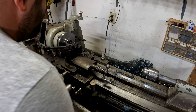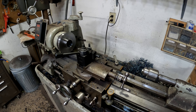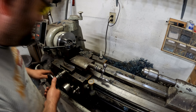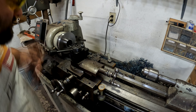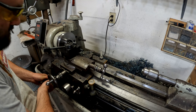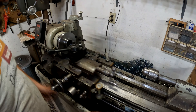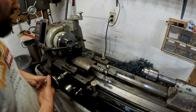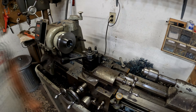At this point I'm removing about a half inch of threads from this end — first of all they're not needed since the spindle isn't that long, but this will also allow me to unthread it and thread it on backwards so I can machine the back side. I wasn't going to machine the back side, but I had a thick spot on the back plate that was making it vibrate a little bit. So I'm turning the ID to 2.001 inches to give me a perfect slip fit for concentricity, then I flip it over and machine the back side.